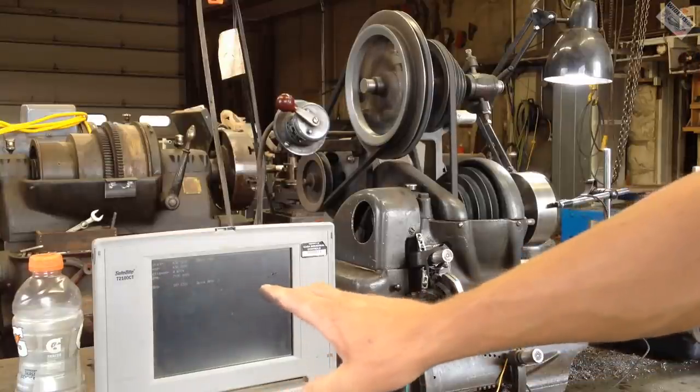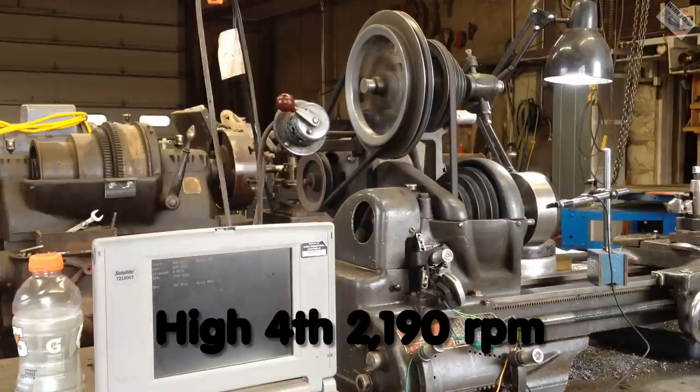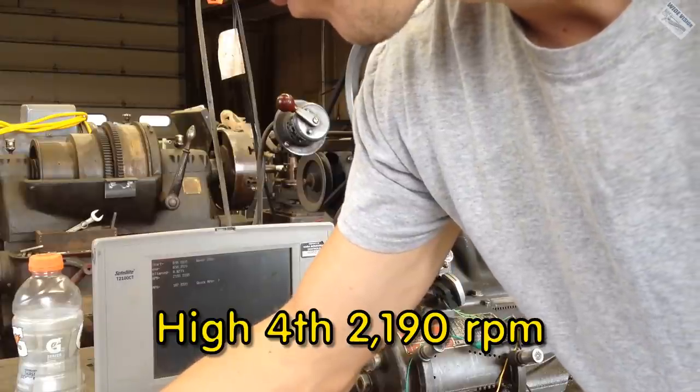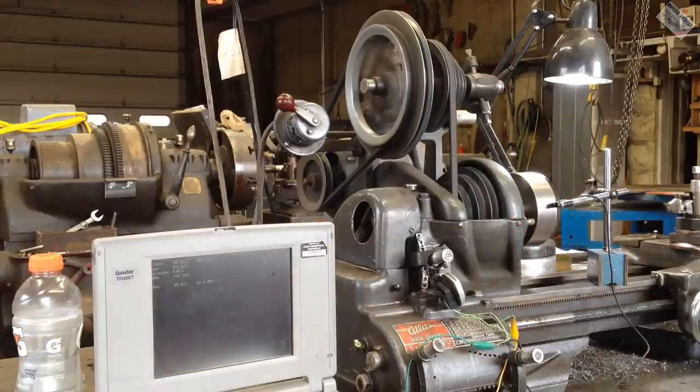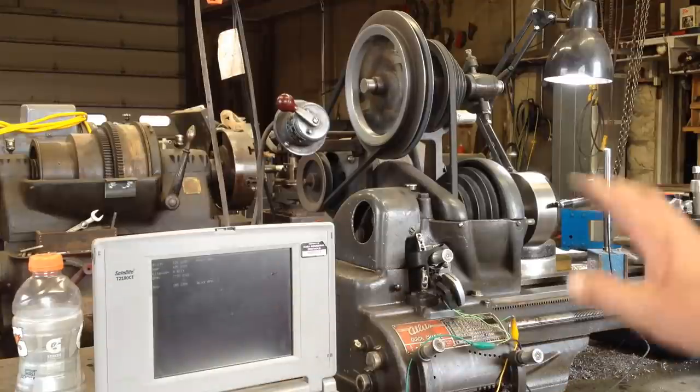I need a part of the program that gives me a high point or an average. I'm going to go with 2190 on that. You can hear the machine kind of warming up and getting in its groove, and the RPM is settling down a lot more. That confirms that spindle warm-up is definitely an issue. It's amazing how much more uniform the RPM count is once the spindle warms up — now seeing 2200 a lot. Lesson learned: spindle warm-up at higher speeds is definitely important.